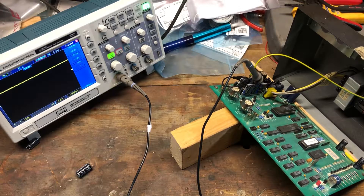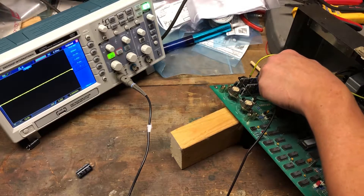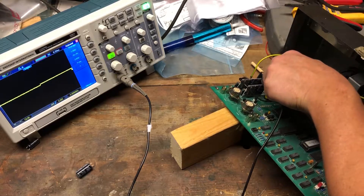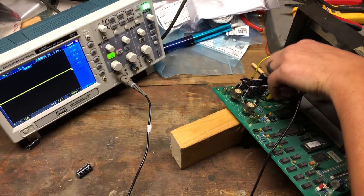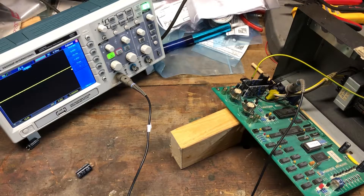What will tell us for sure is we'll check the output of this 5-volt regulator up top, which was the worst one. I'll turn the power off before I move the probe, just in case. Okay, back on — got a pretty flat line. 5.6 volts is what this is reading. I don't know if that's exactly in spec, but it's a lot flatter, a lot cleaner signal. I wish I'd recorded it before the change, but there was a lot of noise and ripple in that signal, almost going all the way down to zero volts. So it appears that these capacitors might have done the trick.